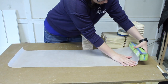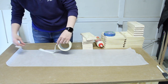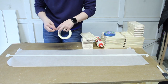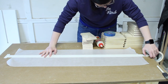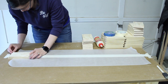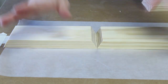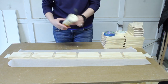For the glue-up process, I'm going to lay down some wax paper to protect my surface, then take some masking tape and place it on the tabletop sticky side up, securing both ends really taut. I only had one-inch tape on hand so I did two strips right next to each other, but two-inch would work a lot better since this tape is going to replace clamps to assemble the hexagons. I then took the first side of my hexagon with the short side facing up, centered it along my tape, and pressed it in place. Taking the next piece, I butted it right up against the edge, made sure they were flush, and pressed them down. Repeat this with all six pieces, making sure there's a really tight connection with no gaps.